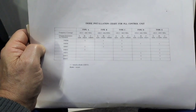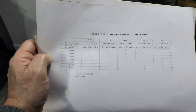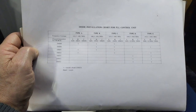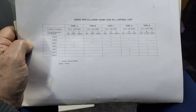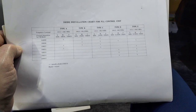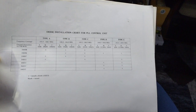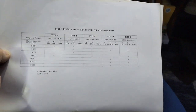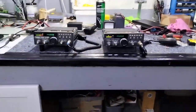So I was thinking: what radio do I actually have here? It doesn't tie in with any of them on the list, unfortunately. To get this radio to operate on 12.5 kHz I would probably need to incorporate the other diodes — either for type E or type D. That's an ongoing job. Just to let you know that although the information in Practical Wireless is probably correct for some radios, it is not for all of them.